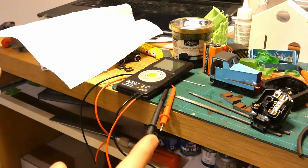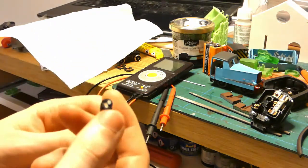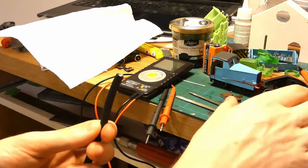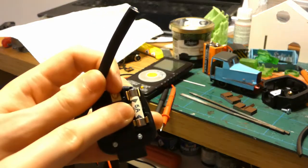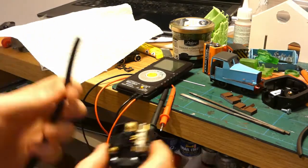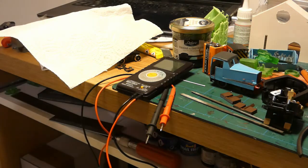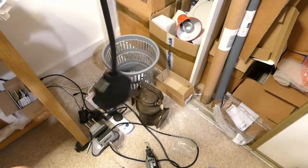And the main point I wanted to show you at this point was this wire is all I happen to have to hand in a large enough quantity, but it's fairly thin. It's only rated to 6.5 amps. So I have replaced the fuse with a 5 amp one. That's important. Don't let anything downstream of your plug be a lower rating than your fuse. Anyway, onwards. I've got my plug all wired up nicely, strain relieved and all.